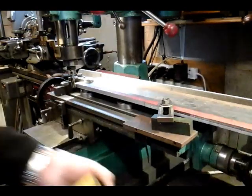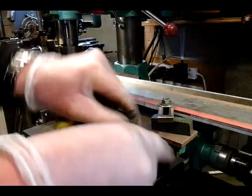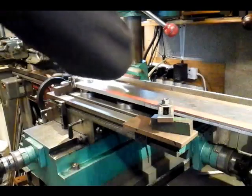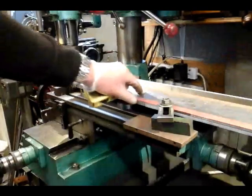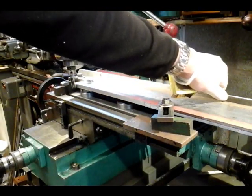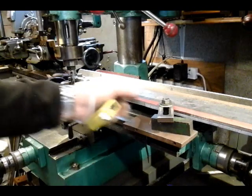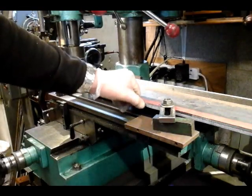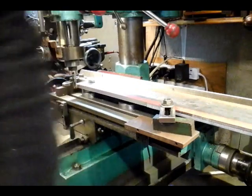To make sure you're cutting right up to the edge of the aluminium angle, I'm using a feeler gauge to make sure there's no gap. I can't get a two-thou feeler in there, so I know it's flush to that edge and that edge is square because I've clocked it up. I've taken a roughing cut and I've just got to take a finishing cut on this edge, then I'll move it on, pick up the bit I've machined, and machine the next part.